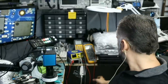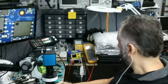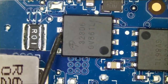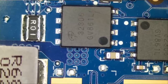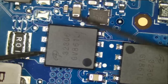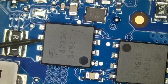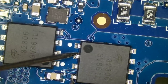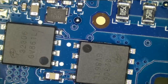Let's see what's wrong with this one. We're going to measure at the power MOSFETs and see if it's the same issue. Meter in diode mode — let's test the drain. Do we have a short? No, we do not have a short, so it's a different problem. We have 0.47 voltage drop — just like the reading we got on the other one after fixing it — and that's a good indication the MOSFETs are good. Measuring drain to gate: no short. To source: no short. No short, no short, no short, and no short. So we're going to assume the MOSFETs are good.